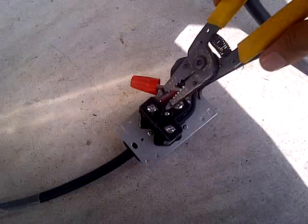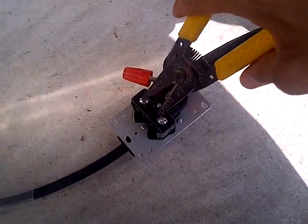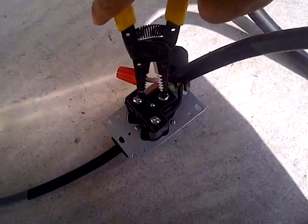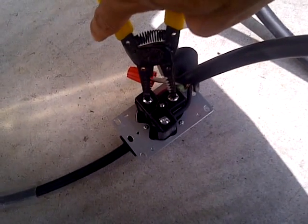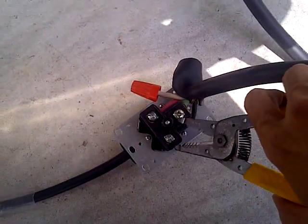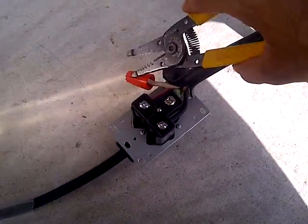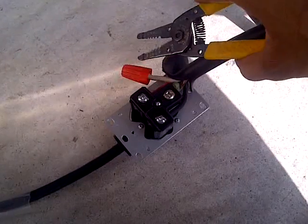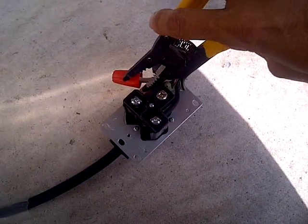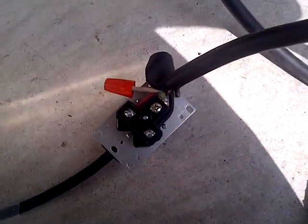The way it's hooked up is you take your two hot wires — the black and this pinkish-reddish one — and this is your common, which you cap off. Then your ground. These two are 120 and 120, giving you 240, or 250 as it says. If you have a digital multimeter, go ahead and test it. Touch it on the back here, and you'll see it's giving you 240 or 250. You can also touch the ground and one of the hots — that would be 125. Same on the other side — 125. That's how you wire it, and the common stays capped. You can make it another 120 if you want by swapping in the common wire.